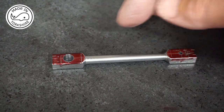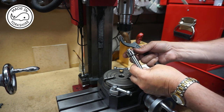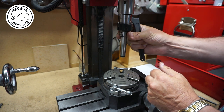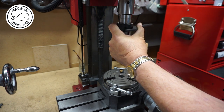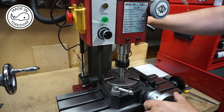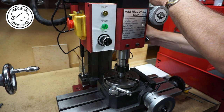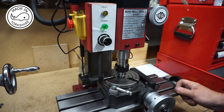Now I need to turn a radius on each end. This is the little device that the Pist Office suggested making - an MT2 blank with 14mm milled at the top. Put it into the 14mm collet, tighten it up, let the table slot into position, lock it. Then it's just a matter of putting clamps on the side, lifting the taper out, and it's spot on centre.